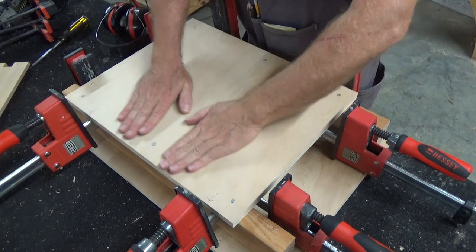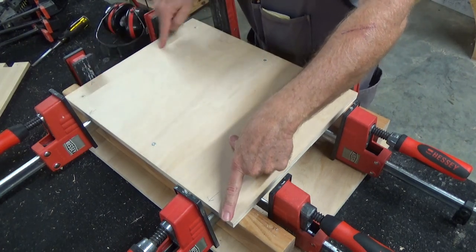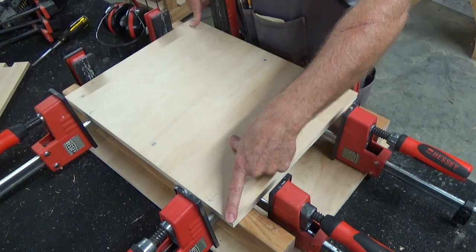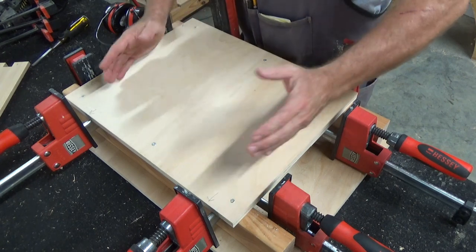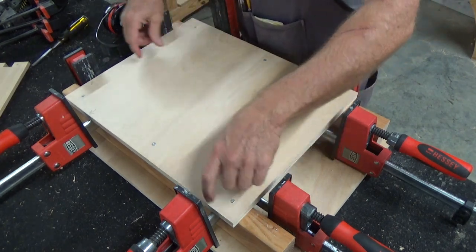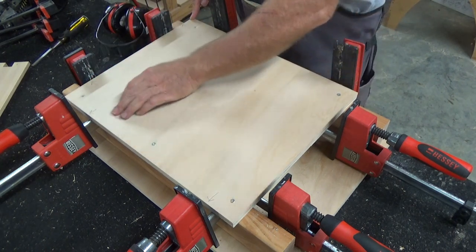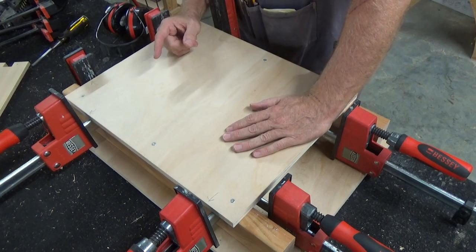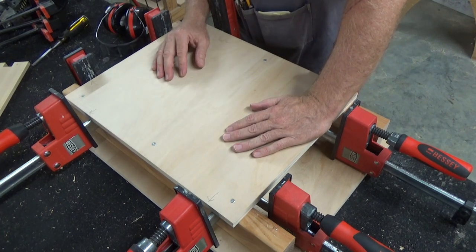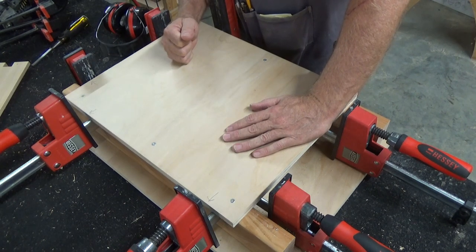And now our top piece is placed on top of here. What I've done was I made sure that when I put my square corner, which is this corner right here, this is what I have to line my box up to when I put it in here, because this piece is a little bit smaller than the inside of a box, because I don't want it to fit really tight in there where I couldn't get it off. So as long as the inside edge of my box is pretty much touching the edge of this line right here, that box is going to be square because we're at a 90 degree angle right here. So let's go ahead and grab a box, four pieces, set one in here, and see how that's going to work out. I'll tell you what, before I even do that, I'm going to go ahead and mount this fixture on my Lazy Susan to really help me speed things up.